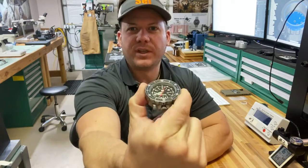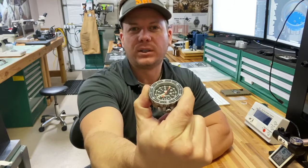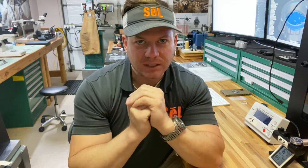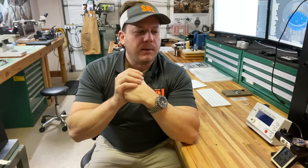To better understand what was going on, we took a picture of this watch at a typical angle you might see on Instagram, Facebook, or a forum, and asked our informal focus group to tell us if the bezel insert was aligned with the dial. 100% of them said no, they are not aligned. So we know our standard assembly process resulted in a two-thousandth of an inch error. I was curious how that stacked against industry standards, so I measured another watch at a similar price point — I won't mention the brand — and their watch had a 0.0063-inch error: basically three times our error.